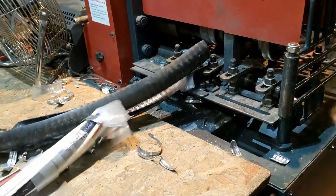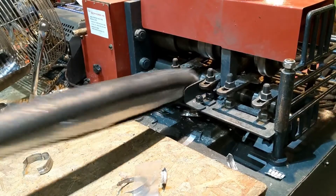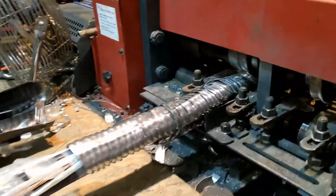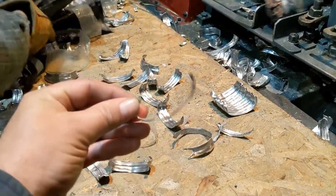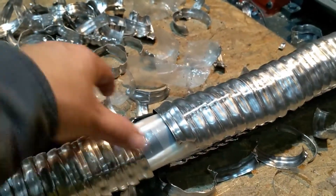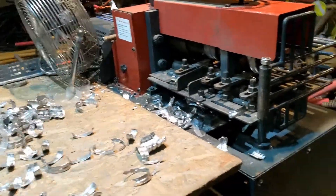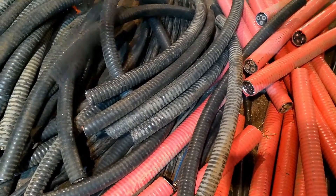The last couple always hang. I may cut my knives over a little bit, cut them sharper on the inside corners — that may help. I had to put more down pressure — I'm putting a lot of pressure, squeezing these things pretty hard. Without it, it was just sitting there spinning, but at least we're spitting through and a lot of it's just coming off pretty easy, but it's not quite cut. Anton is making sure we're only putting the same size through at a time because we've got two-inch, two and a quarter, and two and a half, so sorting is super important.